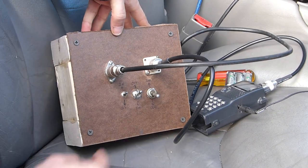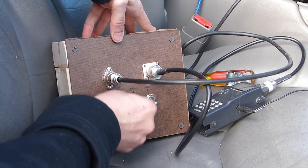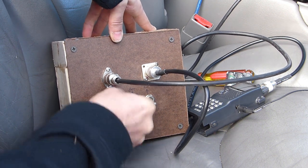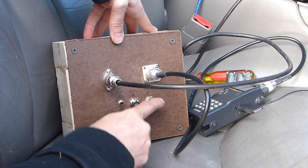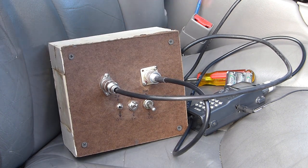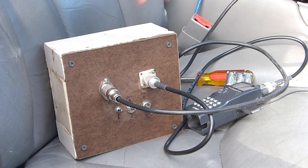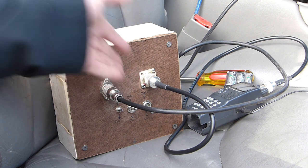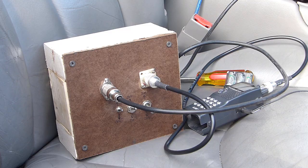Taking a look at the front, I've got three positions. The little switch isn't hooked up because when I started using it, it actually broke and fell apart, so that position is dead. But these two positions are hooked up — this one should cut the signal by about 20 decibels and this one should cut it by about 15. When the switch is in the out position the signal passes through unimpeded, and when it's in the in position it should be cut by roughly 20 or 15 dB, or the two added together if both switches are active at the same time.